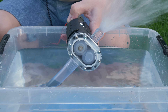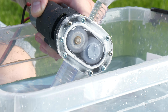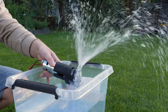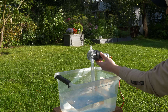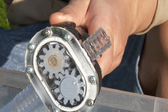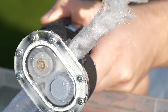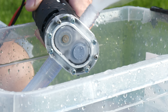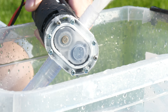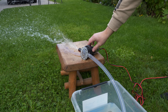I'm happy with how this pump performs, and this pump does not leak. While testing I kept a close eye on the shaft section — that area was completely dry. Looking back at the footage I didn't see any leak anywhere. So now we can say this pump does not leak. This is the first time — I have built pumps that leaked just a little bit, but this one truly does not leak. This alone makes this project a great success. Even though the pump is transparent, there is not much to see inside, so I played with the inlet tube — pulling it out of the water and pushing it back in — to see what happens inside as air gets into the pump.